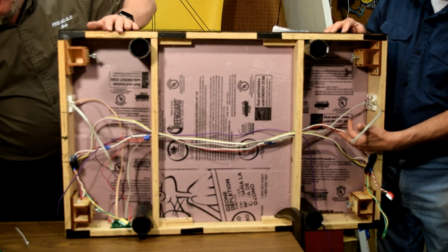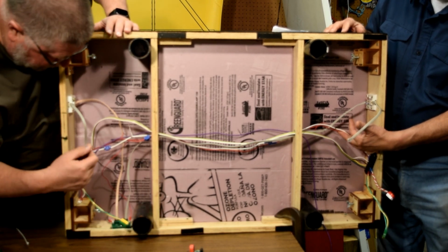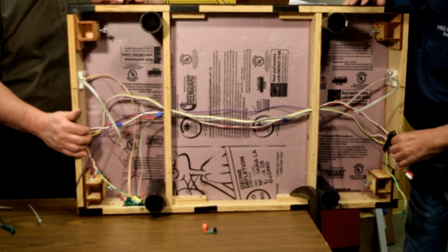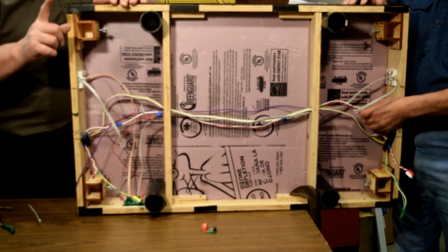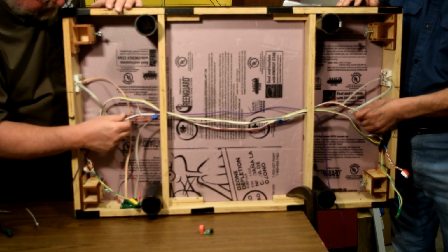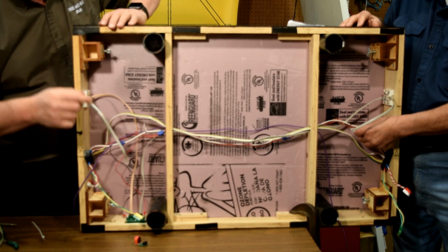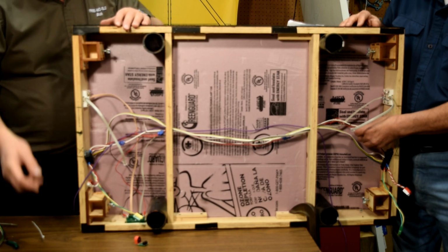So the next thing we're going to do is add our BD20. This wire is isolated right now. You can't really see, but there's no connection on either end. It comes down and it's screwed on, but nothing's connected to it. In one place, and it's very important that it's one place, we will add wires from the pigtails up to this local track bus, the detected bus, and one of those will go through this BD20. We will not do it on both ends. We will only do it in one place. You could do it in the middle of the module or on one end of the module. One place and one place only.